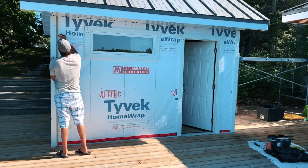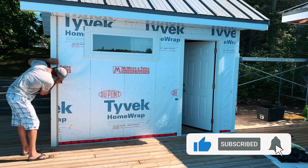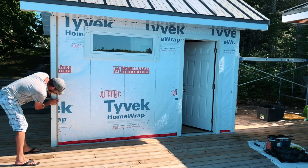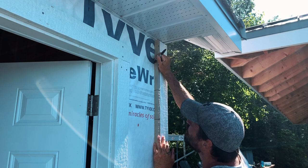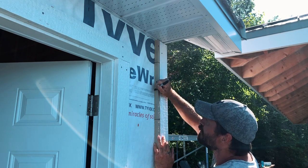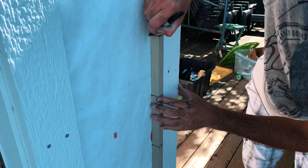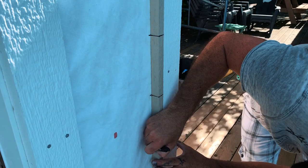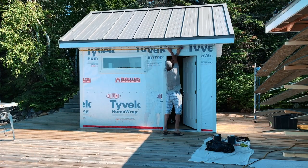Since this brand of siding has no spline on the back, I'm able to choose my own custom overlap, which will allow me to keep a consistent reveal even with my piece at the top edge of the wall. Creating a story pole with markings for the top edge of each piece will ensure that the siding is installed level and with a constant amount of reveal. I'll use the story pole to mark the siding locations on the building. I'll also measure and mark the stud locations.